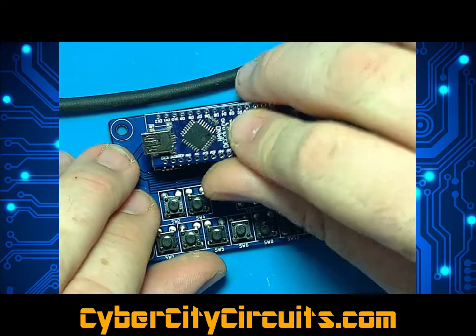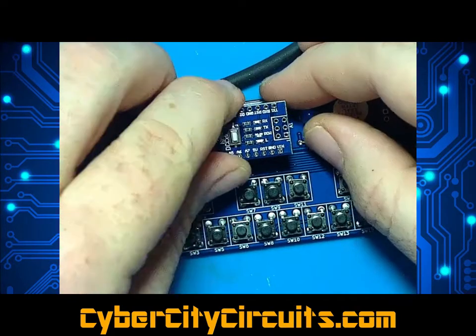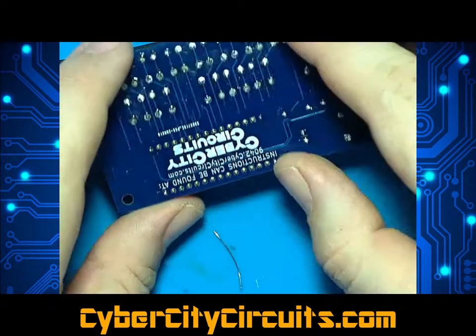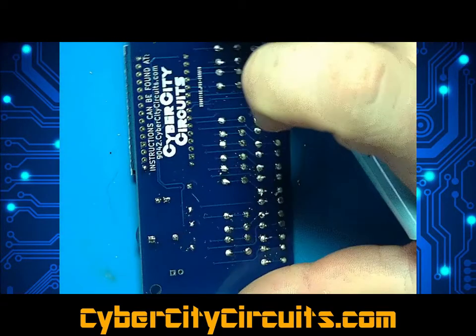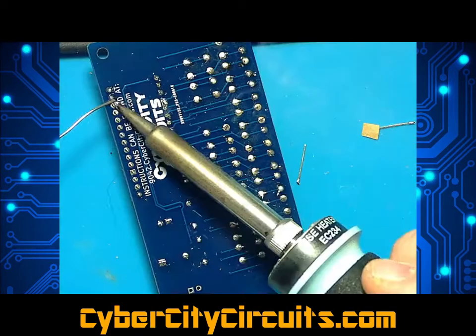So now I have my pins in the socket, and we'll put my Nano on the pins. See that? Now everything's as straight as it needs to be. So I'm going to go ahead and solder these on. Now when you're doing long rows of pins like this, it's always better to go top to bottom like this.